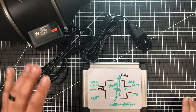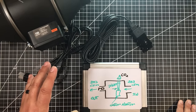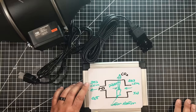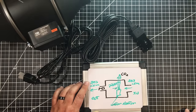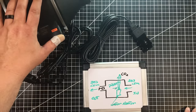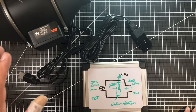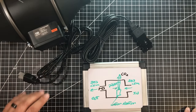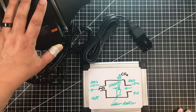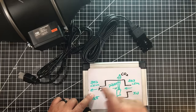One important thing to talk about with air evacuation — I get a lot of questions on this for 3D printers, laser cutters, anything where you want to evacuate air. What a lot of people miss is: if you're going to evacuate 203 cubic feet per minute, you have to replace that air with 203 cubic feet per minute as well. If you're using this in a sealed basement or work area, you're not going to get the results you expect. I hear in comments on older videos about people not getting good results — this is often the reason. You have to have makeup air coming in. I designed this shop to both vent in makeup air and evacuate stale air. Keep that in mind: 203 in, 203 out. If you only allow 100 in, the best you'll get is 100 out.